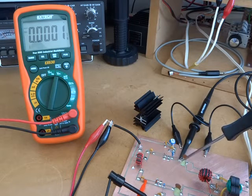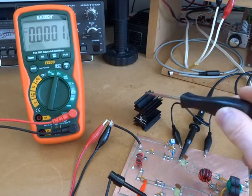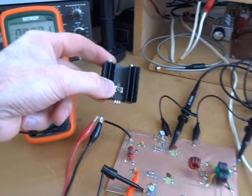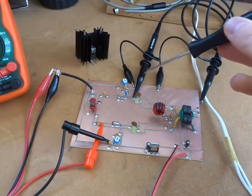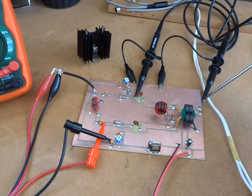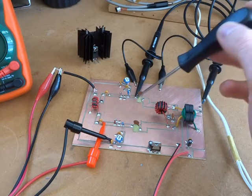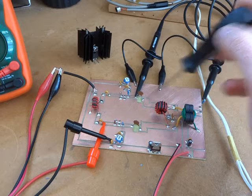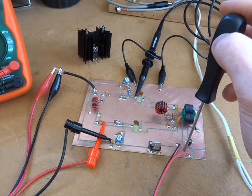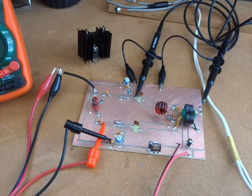I think at this stage I'm reasonably happy to go ahead and disconnect those 2000 picofarad capacitors and solder in the two IRF510s, then slowly liven this thing up. We'll get a good load on the end with no input coming in, monitor the current, and quietly set up those two biases to give 50 milliamps each. We'll monitor the output current here, increase it nice and quietly, and go from there. So far so good — we'll pause, solder things in, and come back with some higher power checks.